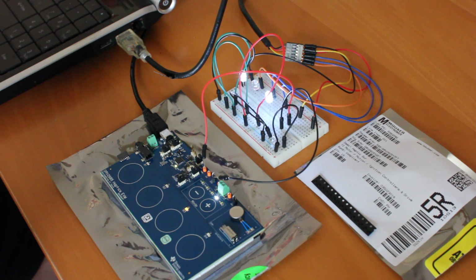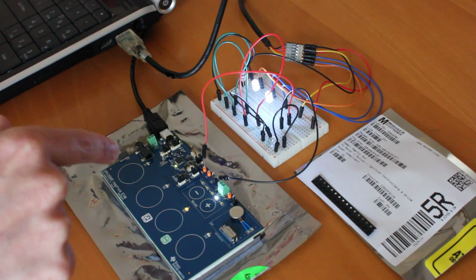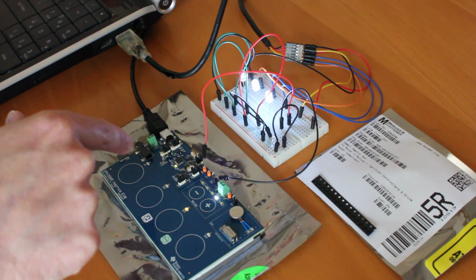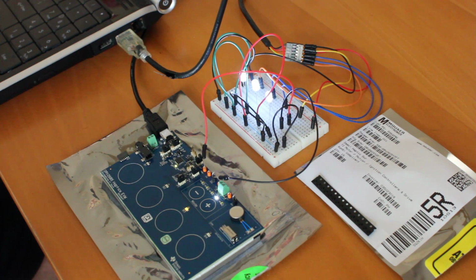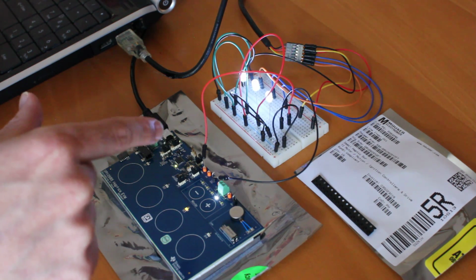Name I'm still working on right now, but another quick update. This is PWM, which works. It's good for prototyping, but I'm going to be switching it over to I2C, which this also has an input for somewhere over here, because PWM is just kind of sloppy. I2C is sort of like the USB of electronics. In the old days we had serial mouse, we had parallel ports for printers, etc. That's kind of what PWM's like. And it's also really power hungry.